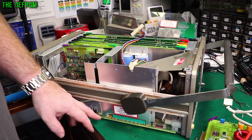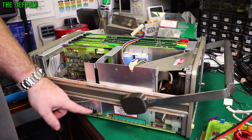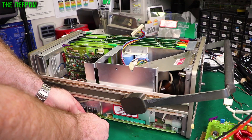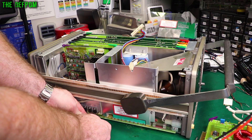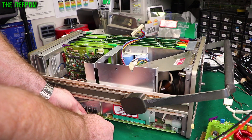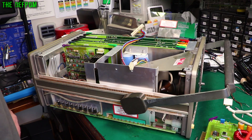That low resistance I've been measuring here looks like it was just a rabbit hole to go down for no apparent reason. That supply apparently powers the CRT. I pulled that board out and we're now getting a lot more resistance - 590 ohms, so 0.59K. That is normal, I wouldn't worry about that one.